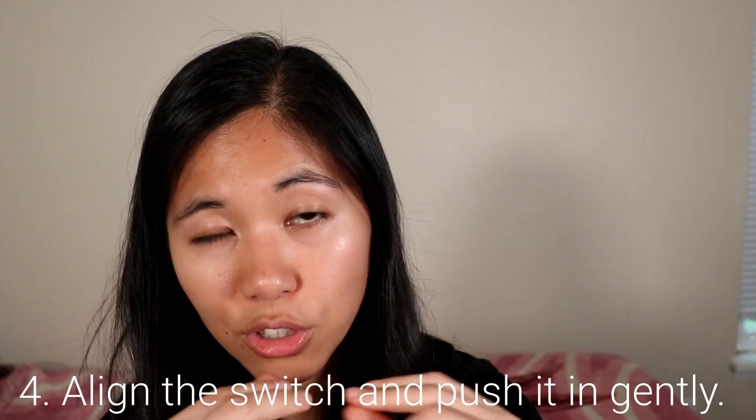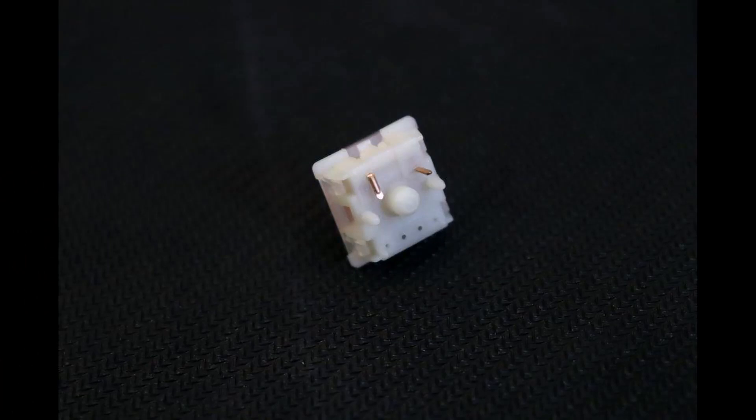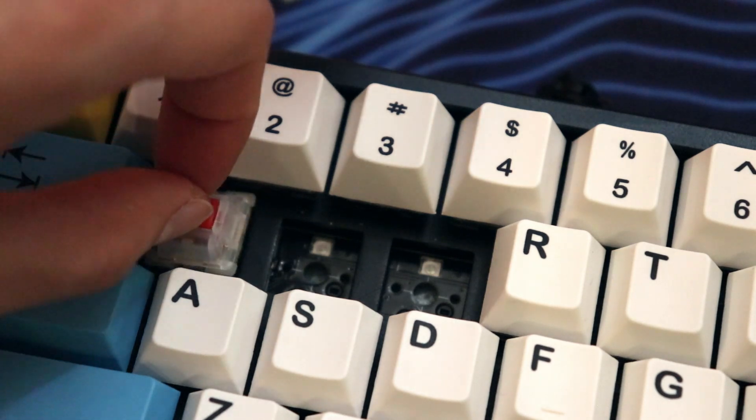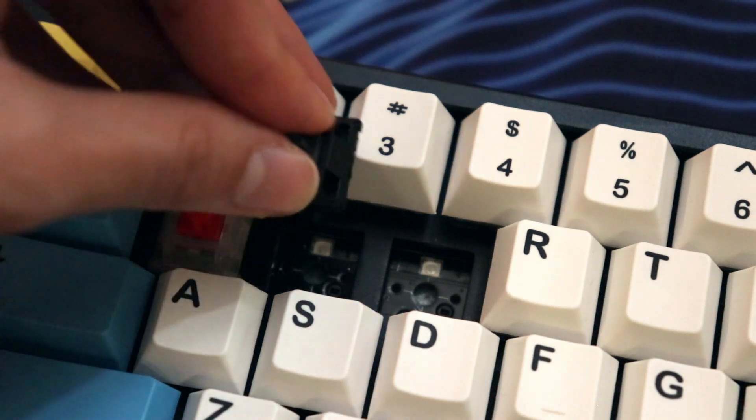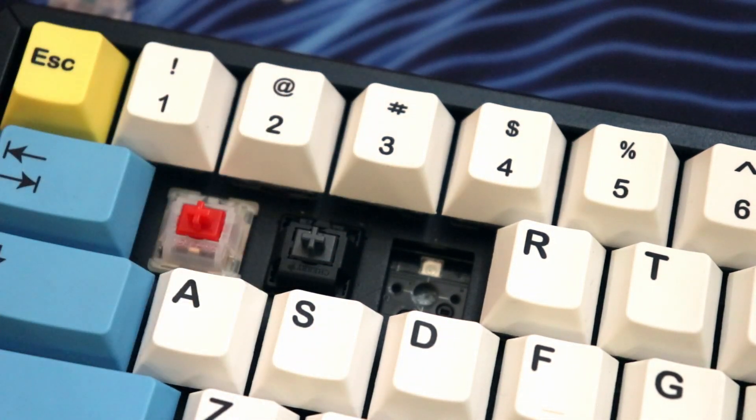The fourth thing is what does it feel like when you press the switch into the board? You want that to be a soft press, and you want to make sure the pins are aligned with the holes. If something feels off, it probably is off and it may cause one of your metal pins to be bent. Don't worry though, because this is pretty easy to fix. To fix it, get either tweezers or a really small pair of pliers and carefully straighten out those pins — not accidentally breaking it and not pulling it apart from the switch. Then just try again: make sure they're aligned and push down onto the plate with even pressure very slowly until you hear a soft click. If you're just pounding them into the board, you're more likely to get bent pins, so take your time.